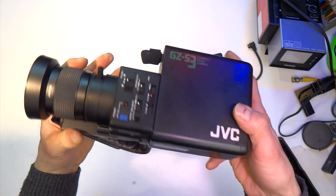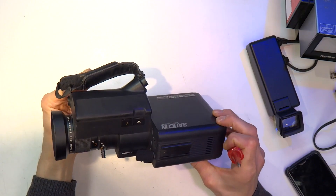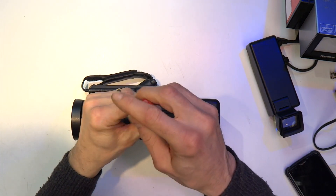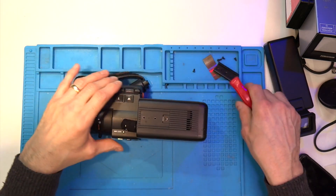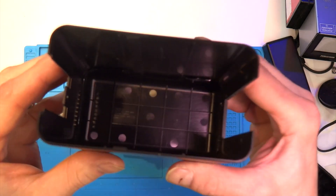This is a very simple camera to take apart — just two screws on the bottom and three screws on the top, two of which are hidden under the hot shoe. Once you've removed the screw on the top of the hot shoe you can slide the hot shoe cover back to reveal the other two screws. Then you're in, and there's a date code of 1983 inside.